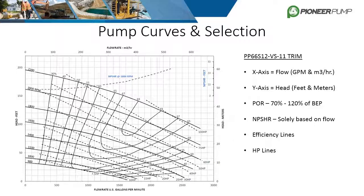The other dotted lines shown on the curve are constant horsepower lines. When sizing the motor for any application, an important consideration is whether the pump will ever be required to operate at a flow rate higher than the design point. If the pump could operate at the end of the head capacity curve, the actual horsepower requirement may exceed the design point selected motor horsepower and overload the motor. For this reason, it is common practice to size the motor for the end of the curve or maximum horsepower requirements.